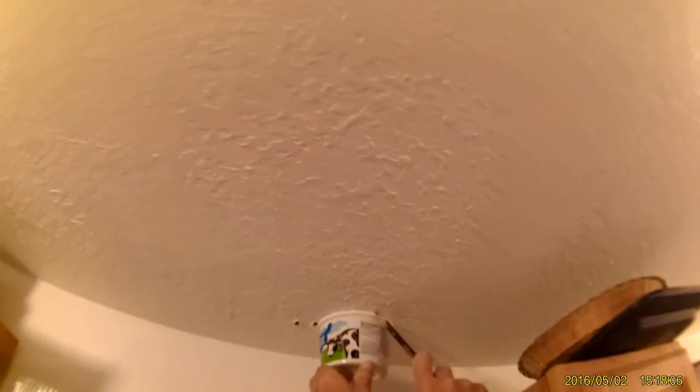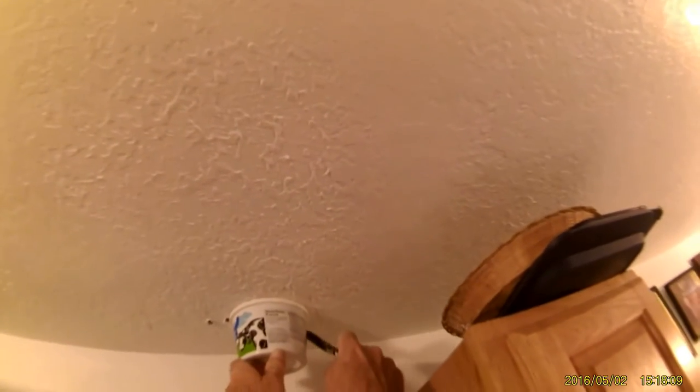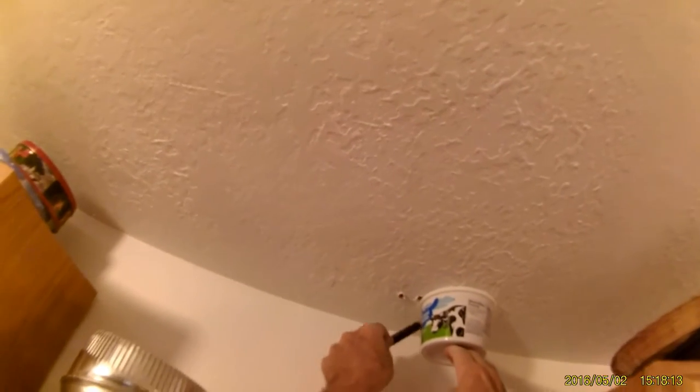I'm wondering if that's — nope. This is a really thick wallboard. So this is a special wallboard cutting saw. Before I go too much further, I want to make a trace around where I'm going to go. I'm going to make a small hole first — something I can stick my hand up through. And if I have to replace it, if this doesn't work out, I'm going to save this piece and plaster it back into place. I don't consider myself that good at it.